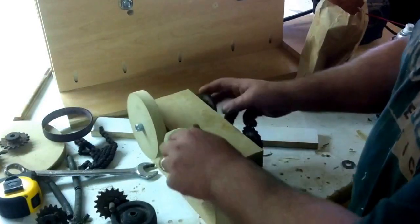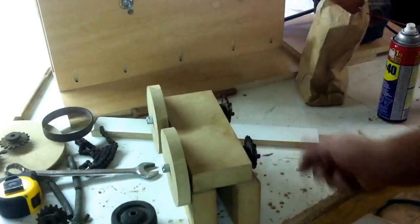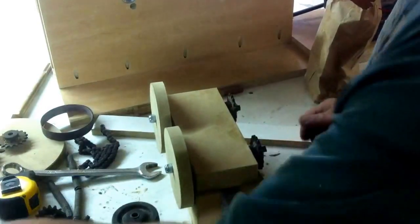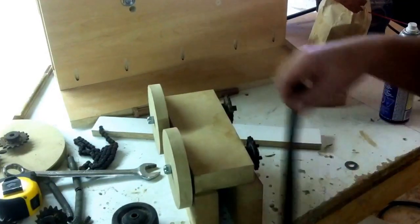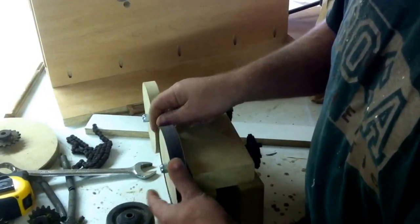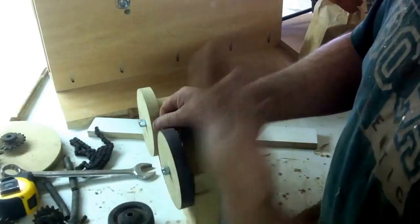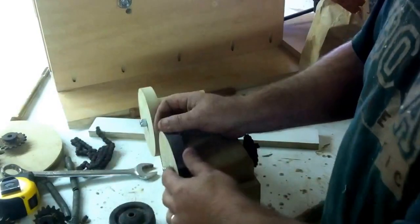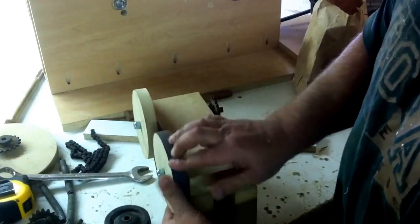So that gets them two running in parallel. Now I just have to get a chain hooked up to these two, and I'm going to have to get a longer bolt to be able to put another pulley on this, because that would run to my drive and then it would turn them together. Now I know that just running on the wood would not grab and make it so that you could pull material through. So what I'm going to do is glue some little strips of sandpaper to the little wooden wheels — that'll make it so that the material won't slip. Most of the time we're just going to be using wood that we're going to route or sand anyway, so this is not going to hurt it any. It might leave a little mark, but we're going to sand it anyway. So just get one of these on either side — that's going to be what pulls the material through.